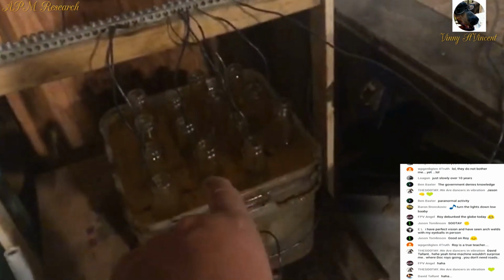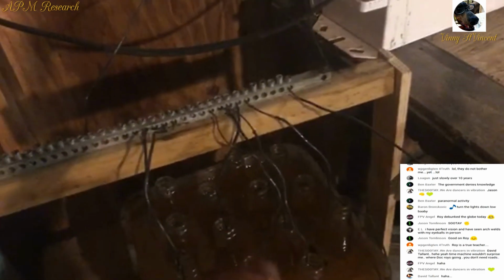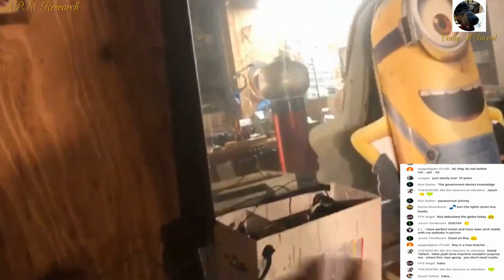And what we're going to do is allow that gap to break from one end to the other. It's going to allow these capacitors, which are beer bottles. Anybody ever want to make a salt water beer bottle bath? Just let me know. I'll post it up. Each bottle represents 1 nanofarad. We're using a 15,000 volt, 60 milliamp NST neon sign transformer. They sell for about $235 online.